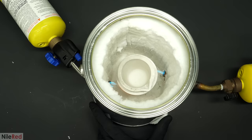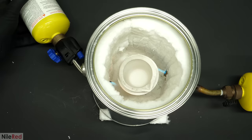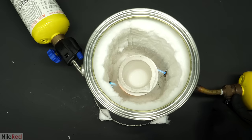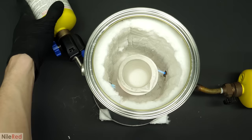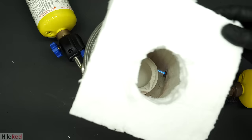As a point of safety, some torch heads, like the one I have on the right, are made of brass. For general use this is totally fine, but in this case the tips of the torches are surrounded by insulation. This causes them to heat up way more than normal, and with brass it can start releasing toxic zinc vapor. For this reason, I did it all in a fume hood, but I probably should have just avoided brass altogether. My torch head on the left is made of steel, and I could have just gotten another one.